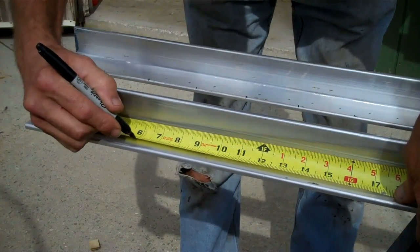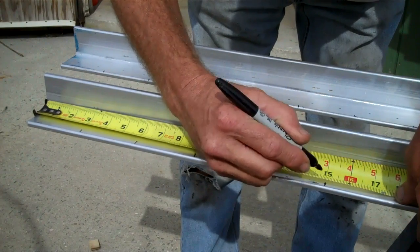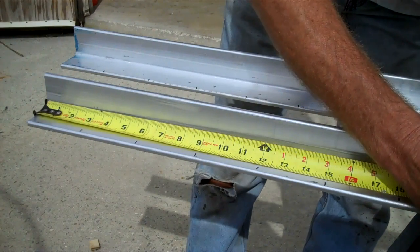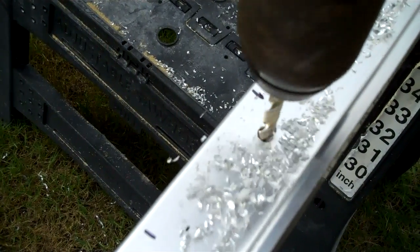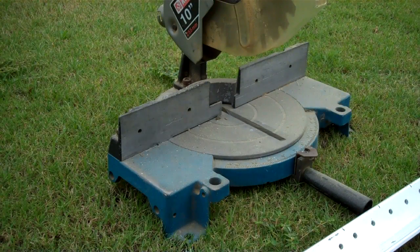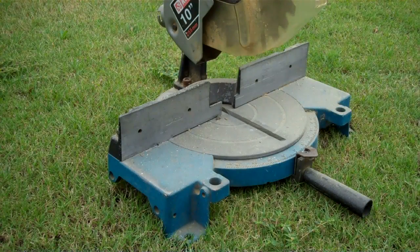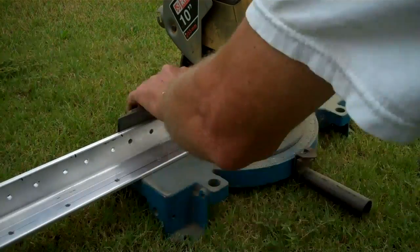I chose two-by-two-by-quarter aluminum, cutting it to three inches long and putting it down with number 10 screws — I did that for the weather we have here: corrosion, that kind of thing, and strength. I'm drilling the holes to bolt to the sides of the panels. The reason I'm doing this in the grass is because if you get aluminum shavings all over your driveway, especially a rough one, you can't sweep them up, you can't vacuum them up — it's a pain in the butt.